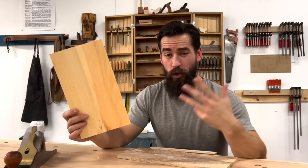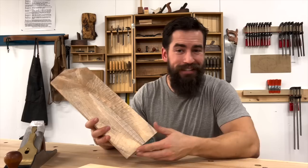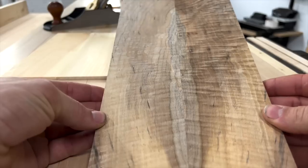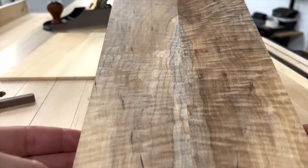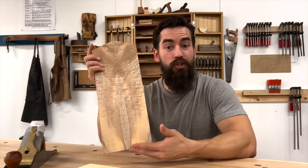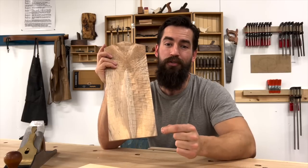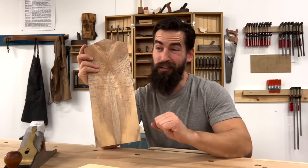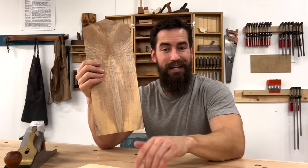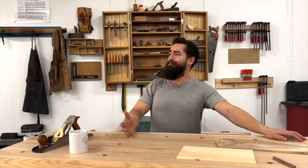Just to give you a real-world example of how this rub joint can come into play — I'm currently working on a tiny little box, just a present for a friend. I have this re-sawn panel of silver maple; it's pretty small. I probably could have gotten clamps on there, but it was much easier to create that joint as a rub joint and make sure all my grain orientations line up precisely the way I want them to, without the fuss of clamping things out of parallel or out of square.